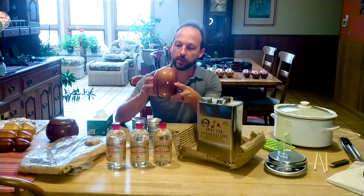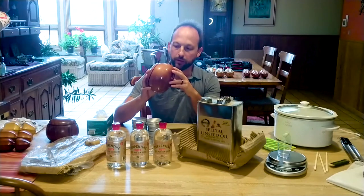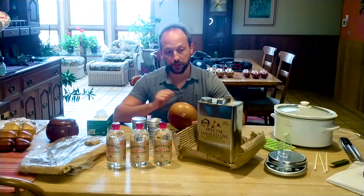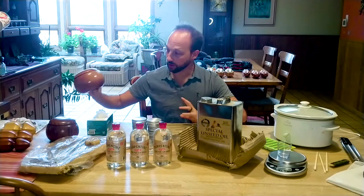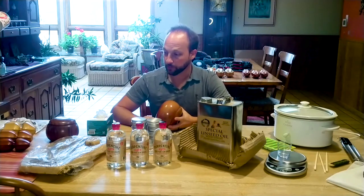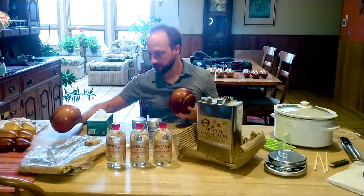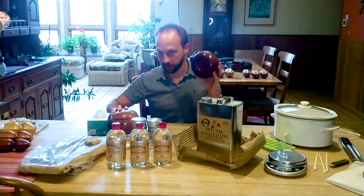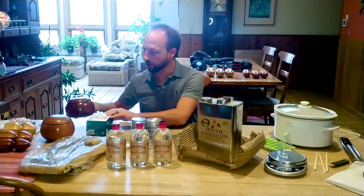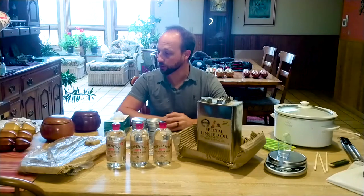What we'll probably do with a bowl like this is take a varnish stripper to dissolve all the varnish off, and then apply a layer of linseed, wipe off the excess and let that cure, and then once it's done, apply a layer of the wax paste. And that should have it come out looking like, it won't look exactly the same because you've got a Zelkova bowl and a quince bowl, very different materials, but it'll come out a little bit darker, but a little bit shiny initially, but it'll probably settle down to a matte finish.